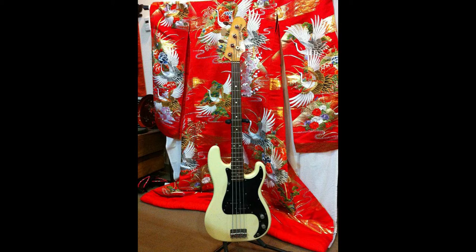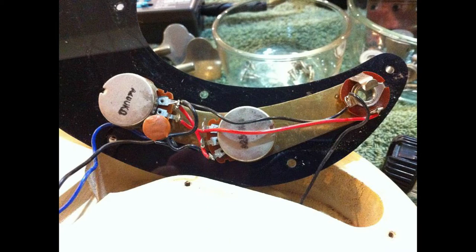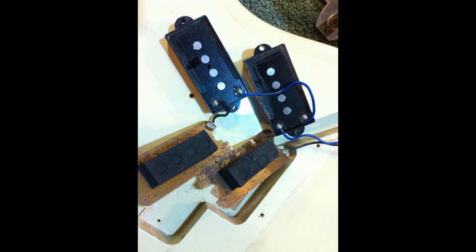The Tokai uses metal plates in the control cavity and underneath the split pickups. As you can see it's kind of a fragile arrangement — this is the original wiring and original components from this mid-80s bass, so I've got to be a little tender with it. I do have continuity throughout the components as measured with the multimeter, so we're actually just trying to contain any interference.